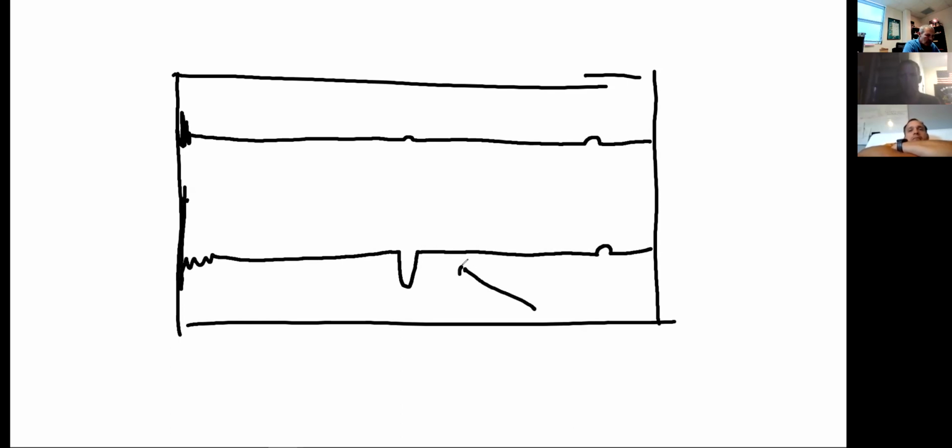This is the one you want to use. It's automatically going to give a hash mark right here. That's the beginning of your cable, and it's going to give you a hash mark right here, right at the beginning of the fault, and automatically at the bottom say 168 feet. That's between the two. You have now radared to the fault location.